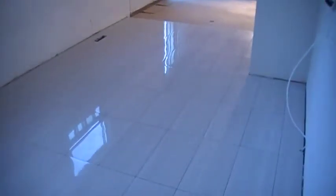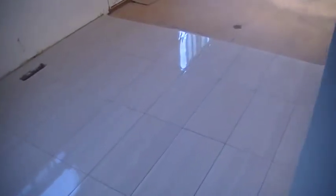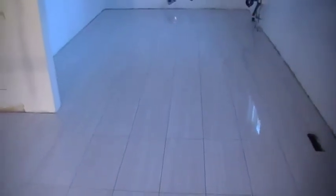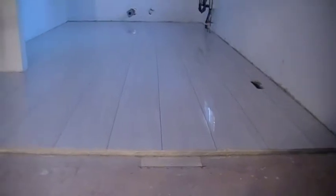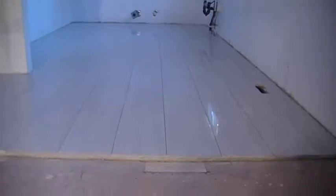As you can see, everything is all rectified — very sharp edges. There's no way of installing these types of tiles anymore on scratch coat or on wavy floors. Ditra is okay but does not level floors — all those floors are still wavy. So in order for your floor to be strong and last long, this is the way to go. This is what this company does: kitchen, bath, basements — especially basements when they are really out of whack.